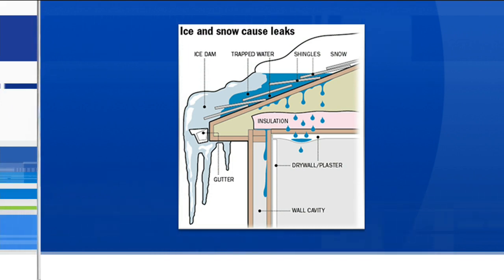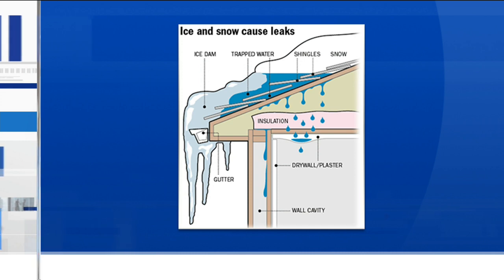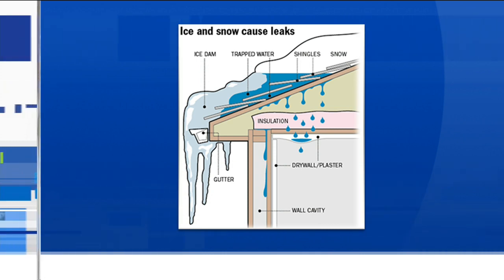Yes, exactly. So looking around today, even with the warm weather that we've had, there's still a good snow blanket on the roofs out there. And what happens is that snow blanket acts like an insulator. Our friends up north have shown us that with a candle you can heat a small igloo. So it doesn't take a lot of heat with that snow blanket. So the heat from the house gets up into the attic, gets trapped in the attic because the vents are covered, and with that blanket, you're going to get above zero. Then it melts that snow layer on the roof, creating a water that runs down.